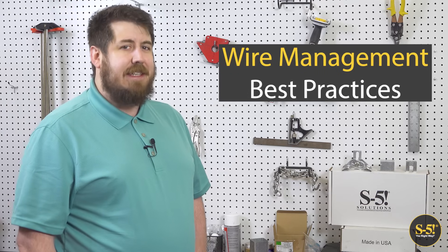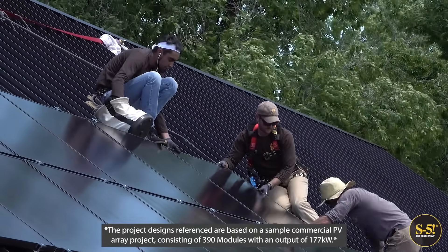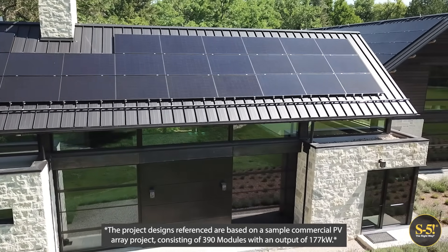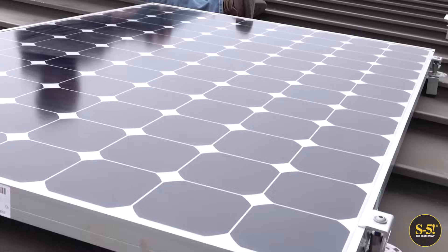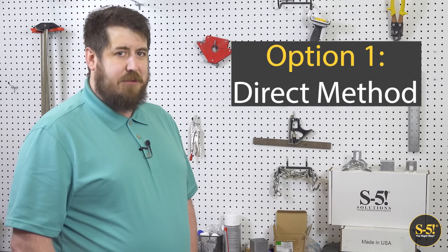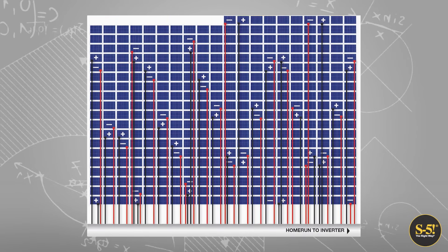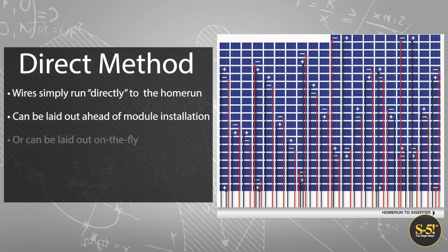We offer comparisons to railed systems to help demonstrate the installation efficiency of the direct attach method. Thinking about how the modules will be laid out beforehand will help you minimize the wires all over the roof. You can design the strings to minimize the wires needed to route the power from the strings to the inverter. We'll show you two ways to lay out your wires and explain how you can save time and money by choosing the right wire design for your roof. The first option is the direct method. This method enables you to lay out your modules and strings close together. On the right, you can see that it will take a lot more wire to get to the home run, which is why your string design is so important. Design your strings to make it easier to wire them together.